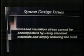One thing that we can't stress enough is that to achieve an increased stress on an insulation system, you can't just get there by taking insulation out. And that is not what we did at all. To get there, you have to understand what you're doing. You need to understand the electrical stress itself, and you need to use enhanced materials to give you the performance that you require. So it really is not a matter of simply reducing the build.